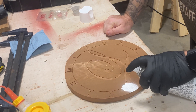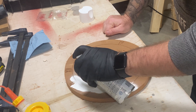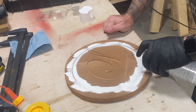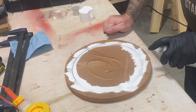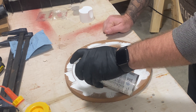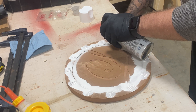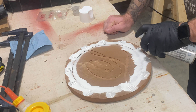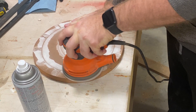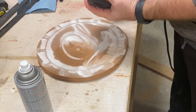And here's where the wheels really fall off. If you've watched my channel at all, you know painting is not my strong suit. I forgot to seal this wood with any kind of lacquer or shellac. What ends up happening is that paint really soaks in because this wood is so brittle — it seems like it's very open-grained. The spray paint really sunk in there. I end up sanding it off and giving it a shot, but by the time I sand off enough of the wood to get rid of the paint I wanted to get rid of, I'd pretty much sanded into a lot of my engraving. I had also changed the engraving to only go about a 32nd of an inch deep, which meant I didn't have a lot of depth to spare. This was the very definition of an epic fail.